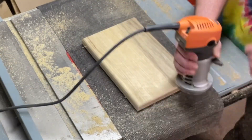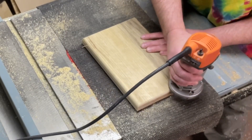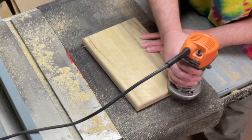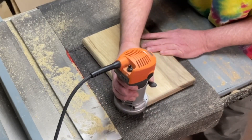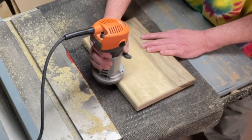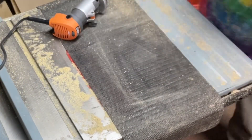I didn't record when I made the underside of the top. I took the inner dimensions of the assembled box, cut a piece of Luan to fit just inside that dimension, centered it on the bottom of the top, and I'll show you here in a second what that looks like.